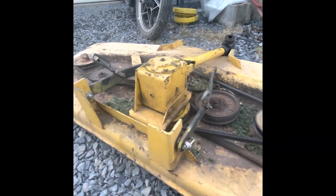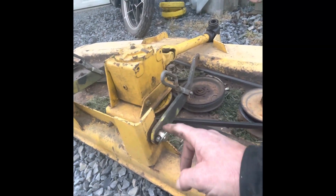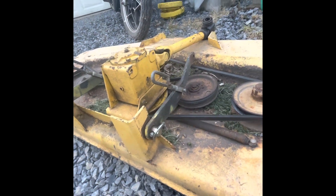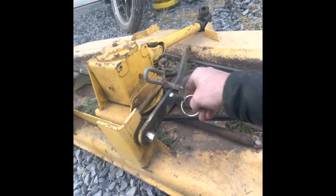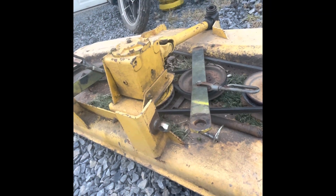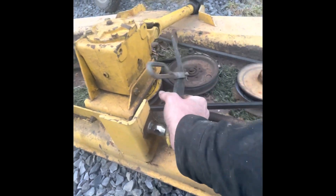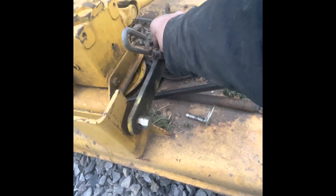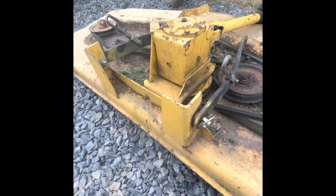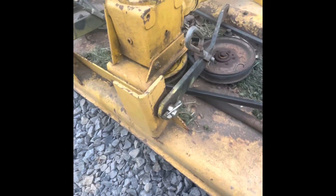One of the things that seem to wear and tear on these are the lift arms — I've seen the bolts waller out on them and there's really not much you can do. You can get on eBay and find these arms, but what I did was go to Tractor Supply. Because of the wallering I had on mine, I bored it out, used Category One quick-connect clevises and put them on, and again I used another quick pin for that. This works really well just to get your system back up and rolling again. It might not be for everybody to fix it this way, but I found it to be a solid fix.